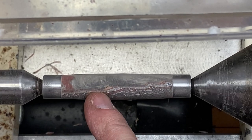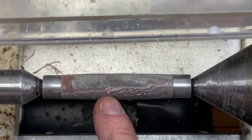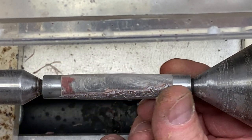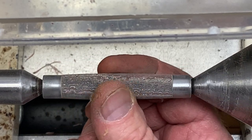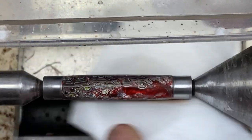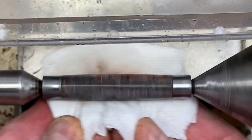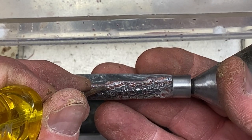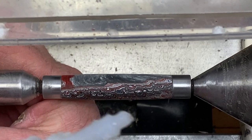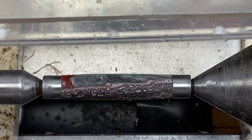I thought I felt something — we've got a little chip there that's missing. I don't think I did that; I think it's just a void in the paint. So what I'm gonna do is clean that out, we're gonna get a little isopropyl alcohol, wipe this blank off, and I'm gonna put a dot of CA there and then we'll go back and continue sanding. I've got it down to the bushings on both ends; I've got a nice shape. There's maybe one little hump right about there so we'll get rid of that as we get rid of the excess CA. Looks like the little void is full of dust so I'm just trying to kind of clean some of that dust out. It's right there where the paint meets the resin — just a little void. I'll put a dot on there and hit it with just a little bit of activator.